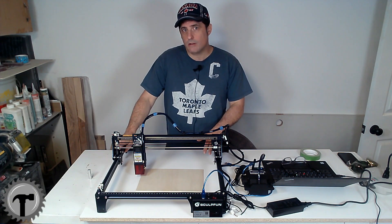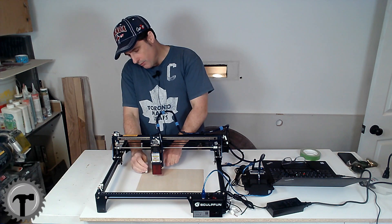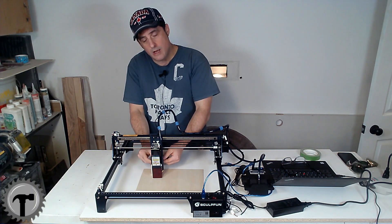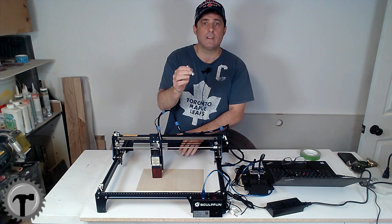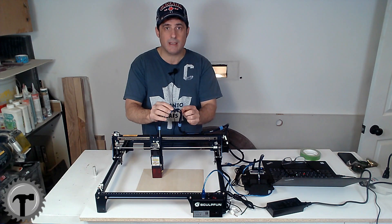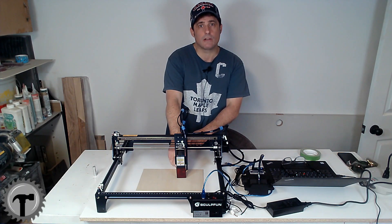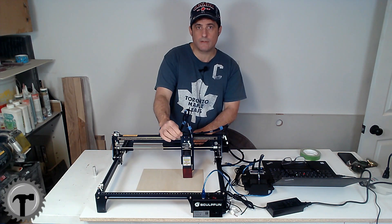I have a few little complaints or things that worry me. One is this spacer right here. What it's for is you take the laser itself, put it over your product — whatever you're going to engrave — and put the actual spacer down to the side. There are two screws in the back; you loosen them, drop down the actual laser, tighten the screws, and take the spacer away. Now your laser is focused. I can just see I'm going to be losing this, so I should order 10 or 15 of them in advance. Another thing is the air assist tube — as you can see, it's kinking right here, and when I move it over, it's fully kinked here as well. I'm worried that the oxygen it's providing the laser may not be sufficient when I'm cutting wood and the laser is all the way over on that side, so I'm going to test that out in the near future.